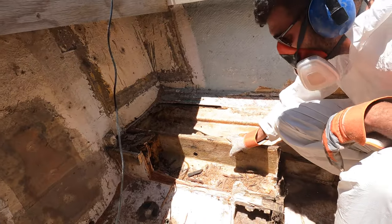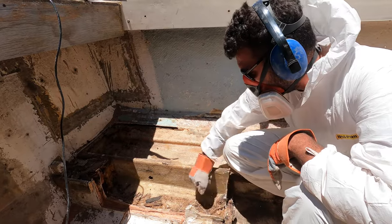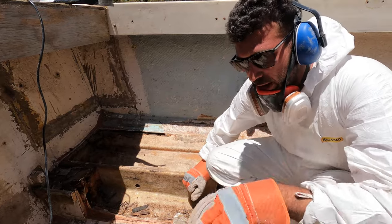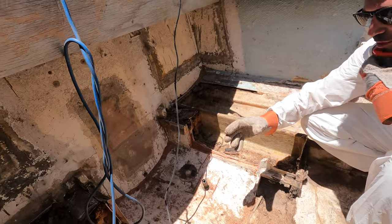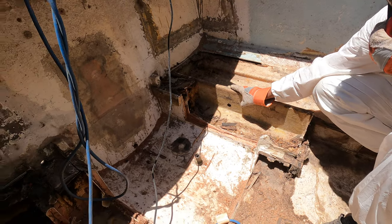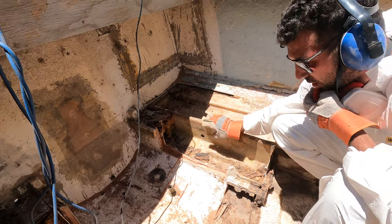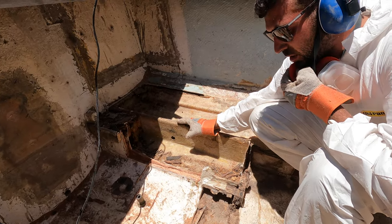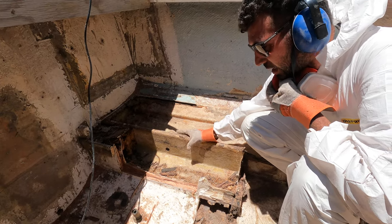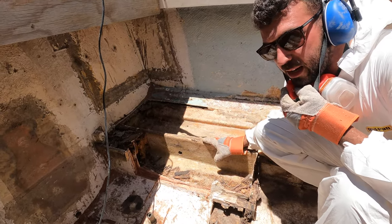Hopefully you can hear me alright, but we've just removed the inner stringers, which gives us access to line down the fiberglass. We'll remove this one here. We've done the starboard side — probably about 200mm off the transom. We just removed this last stringer and I reckon we'll probably do the transom in another video. It's taking a little bit longer than we thought to cut these stringers — they weren't as rotten as we thought. Cutting into dry wood is a lot harder than cutting into rotten wood. Rotten wood is basically gone so you're just cutting the fiberglass. Let's get this last stringer out, remove the rest of it attached to the transom, clean up the hull a bit, and then we'll call it a day.